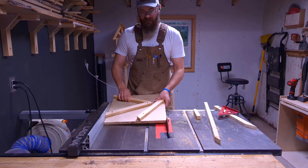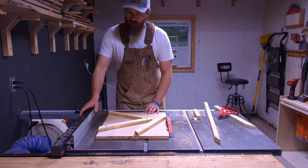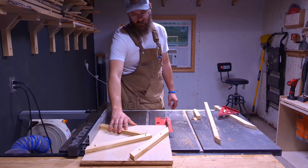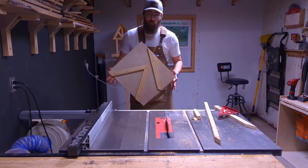One other thing: I did not put a track at the bottom because I don't want to spend a lot of time making these. The way I set it, I butt this up against the table saw blade and slowly tap my fence into place until it just holds the fence secure and pulls on the blade just a little bit — that's where I want it every time. As much as possible, do not pull the sled back while the blade is running. Run it through, turn the blade off, then bring your jig back. Pulling it backward risks kickback.